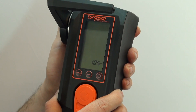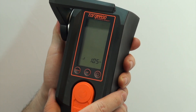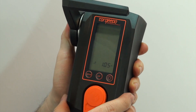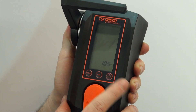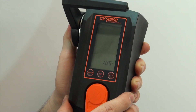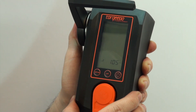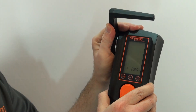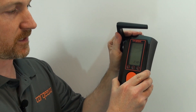If you have one battery, that would be the amp hours you need to go off of. If you're using two batteries for 24 volts, the amp hours for one battery is what you use. If you have four batteries for a 24-volt system, then you want to double it because you're adding them in parallel. So in this case, you would bring it to 210 — carefully adjust that until it's down to 210.